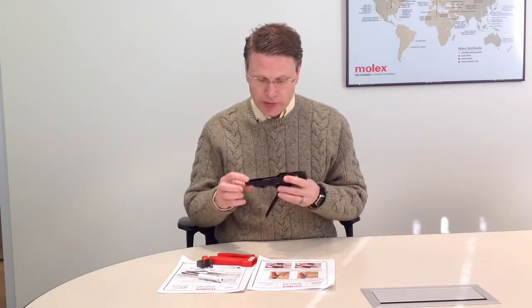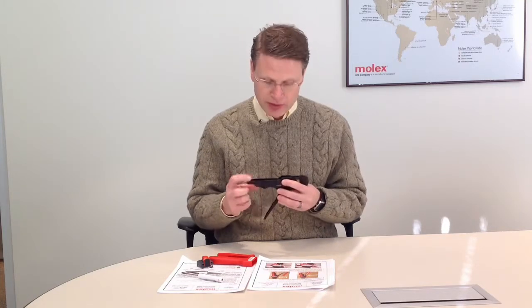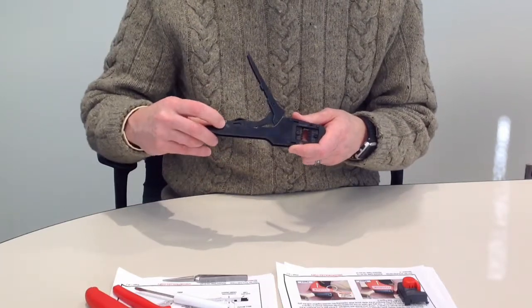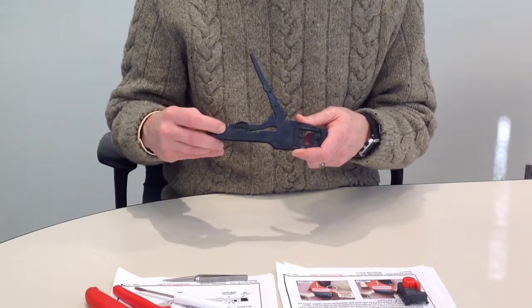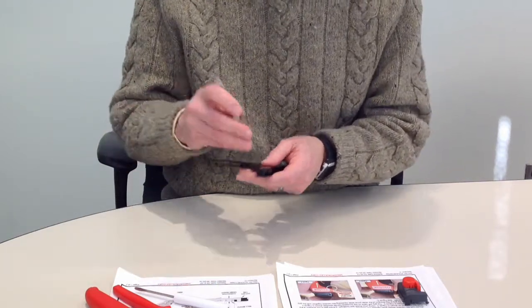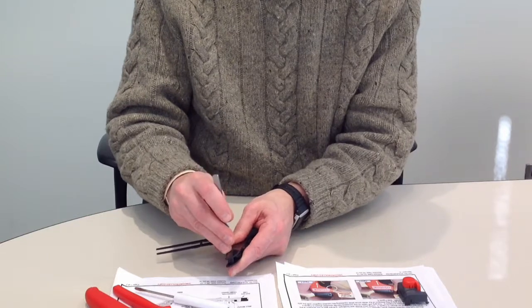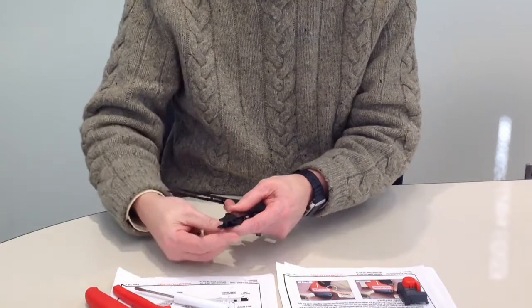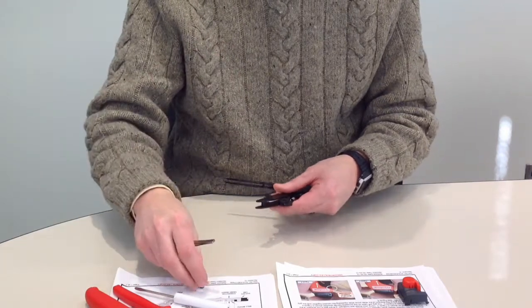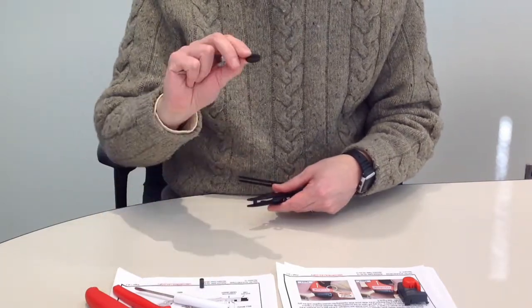In this hand tool, the spring — yours is probably going to be missing or broken, but this one is fully operational, so I'll just remove it now. To remove the return spring, we need to first drive out this pin, which is a setting wheel pin. You can do that with a pair of tweezers or a screwdriver. So we're removing this pin and remove the setting wheel.